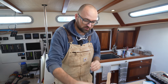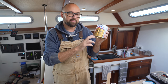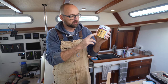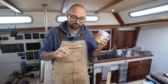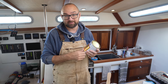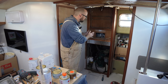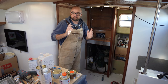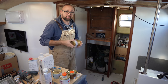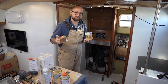I do have a more traditional polyurethane varnish here, which I could apply. It's going to make my life a little bit more difficult. The touch dry interval for this is around 45 minutes to an hour versus 15 minutes on the Clear Wood Sealer. That's bad news, because there's plenty of other stuff I wanted to work on in between coats, and this longer interval is going to eat into that. But what's even worse is that the overcoating interval for this is six hours versus two to three hours for the Clear Wood Sealer.